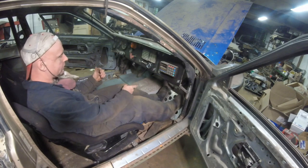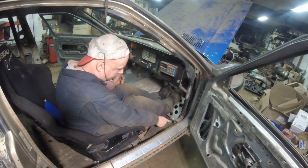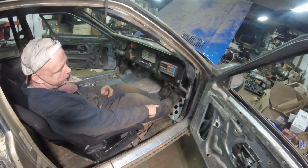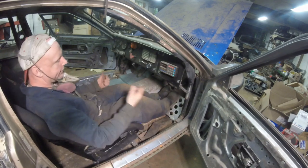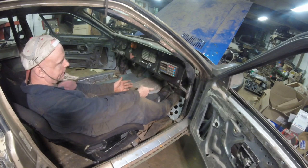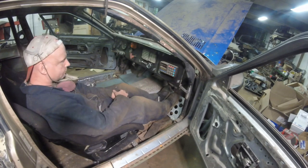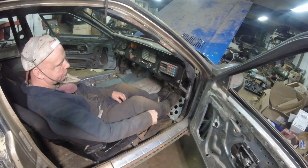Also, I think the top will definitely need to be tied in, so I got to find some metal to tie in the top, and I got to get some metal to go from the bottom over. Right now, those posts on the mount are not going anywhere. They're solid against the back part of the wheel, on the back part of the footwell. So I think I'm really good right there. All I do is mark it and clean it up so I can weld it.